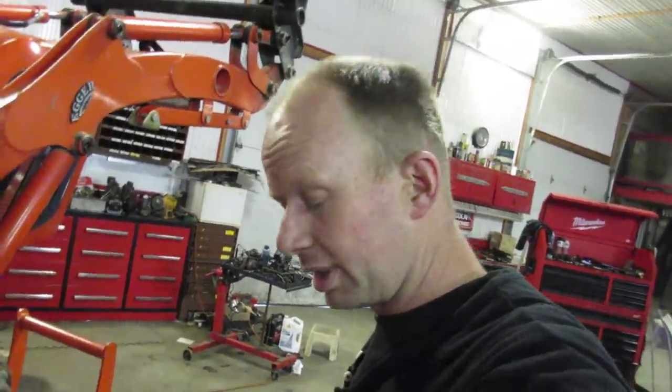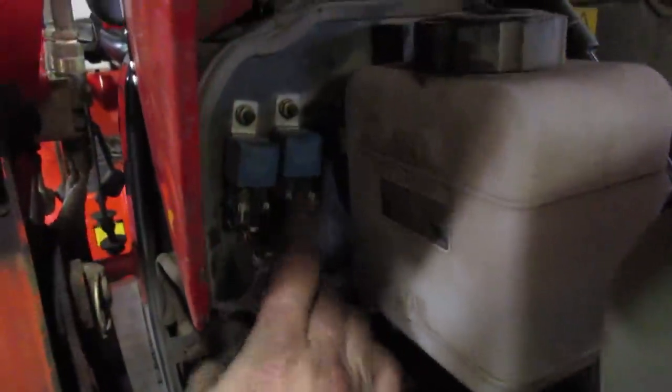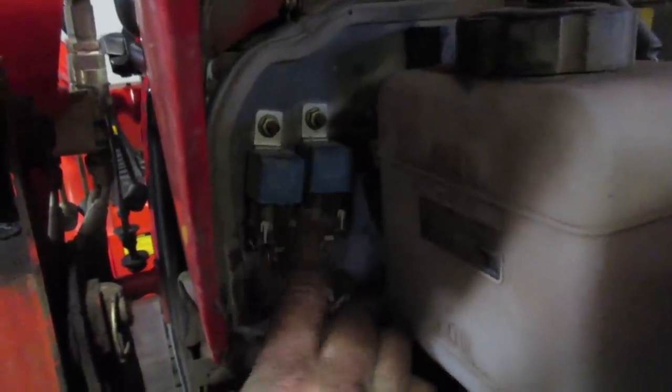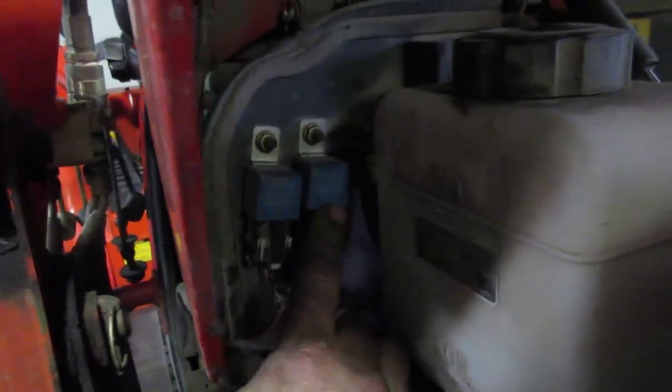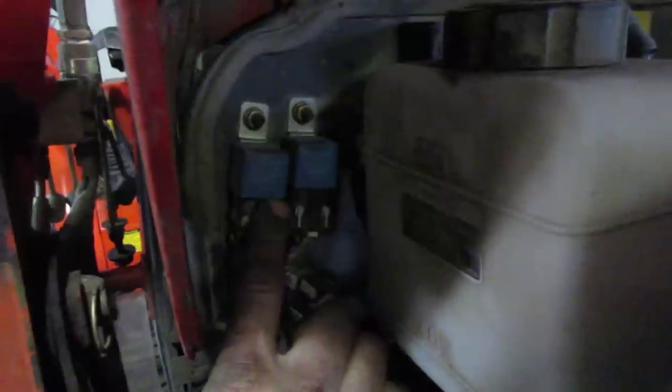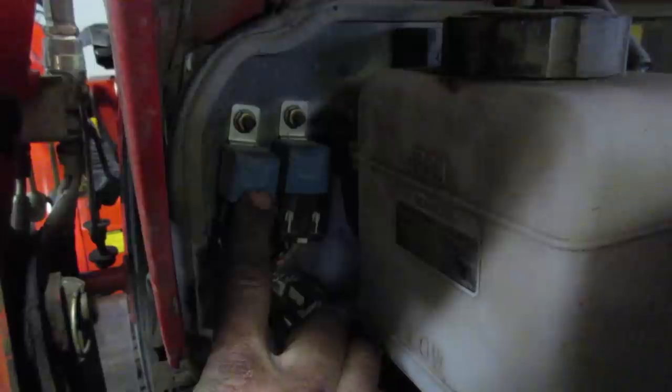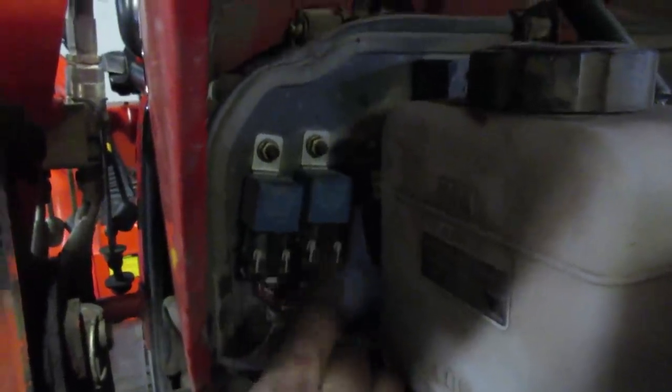We're keeping an eye on the glow plug issue. If the glow plug light stays on permanently it will eat your alternator and battery, as glow plugs draw a lot of current. The relay might simply be sticking. What I did was swap the relay plugs around — now this one is the glow plug relay and this is the hold relay. If the relay was sticking the glow plugs will still work but won't stay on. Next time I see the tractor I'll swap them back and dig deeper into the glow plug timer if needed.